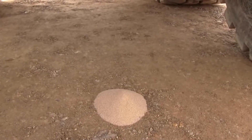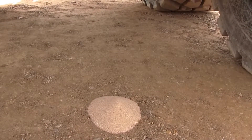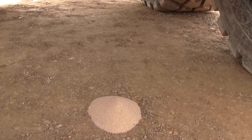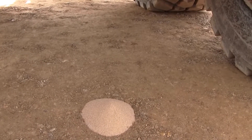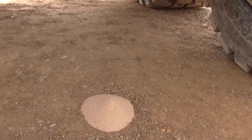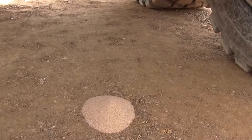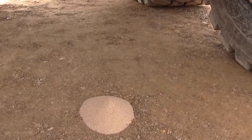The first thing we need to do is prepare the ground. We've got a nice flat surface, but we need to use some bedding sand to put underneath the plate so the entire surface area of the plate is in contact with the ground. We don't fill any holes with natural material — we use a bed of sand which is very, very thin, just filling those voids.